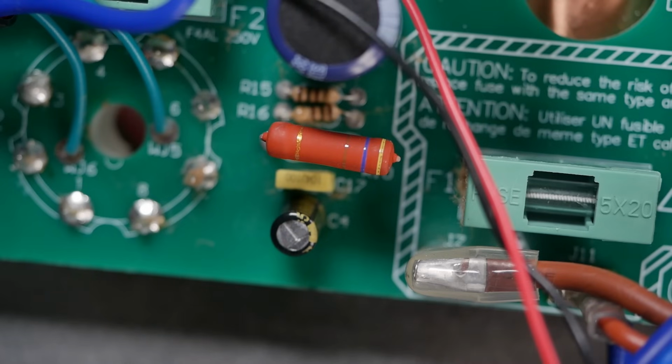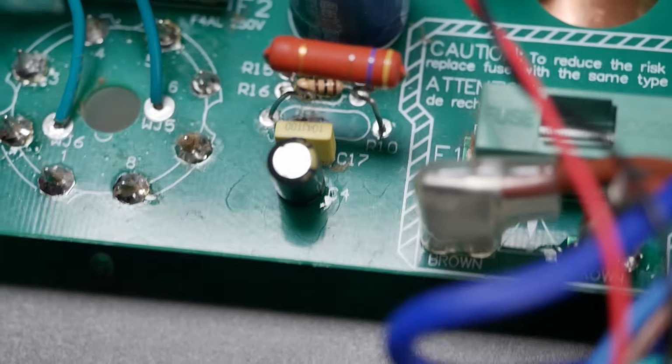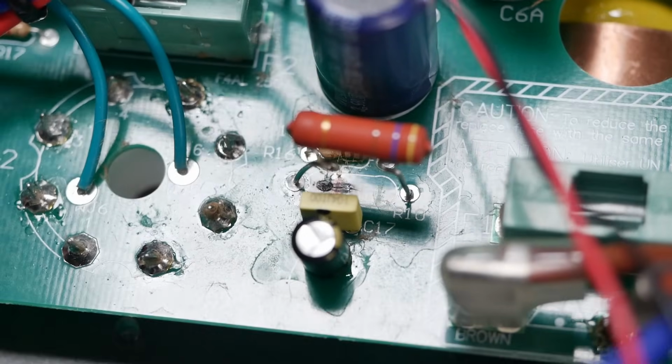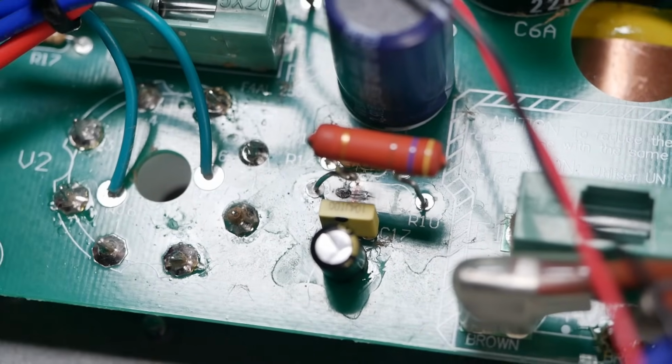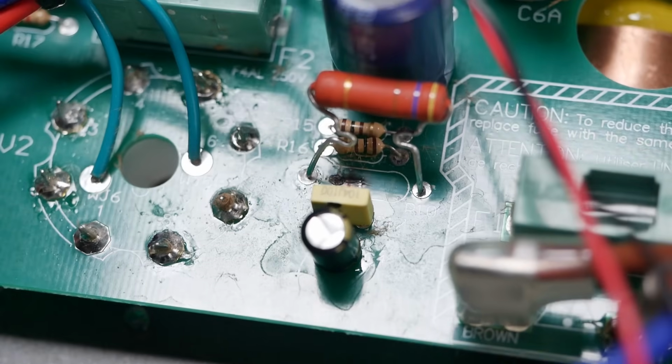You've got what appears to be a V-shaped metal film resistor there, 470, so I'm guessing that would be the cathode resistor. Actually, wait. Okay, hang on a minute. So they said customer return. This has actually been refurbished. So that's been installed by someone after the fact, and you can see there's a burn mark down there.